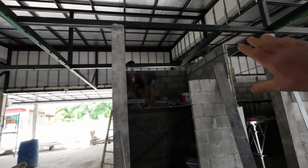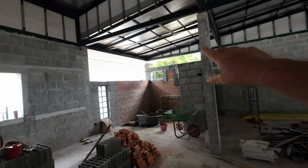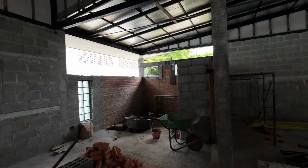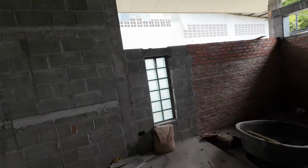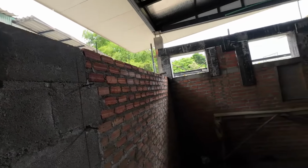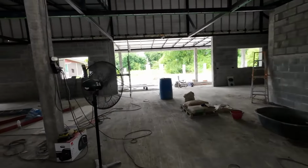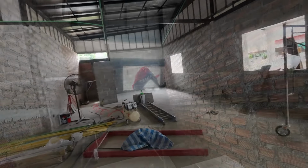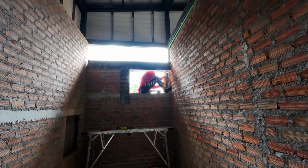Okay, so they're just about finishing here. The block work here. They finished pouring the concrete lintel. And this beam there. We've still got this one to do now. This is all poured now and finished. So now they can pour a lintel in, straight across there, tie that in. So, now they're doing. Make sure everything's level.